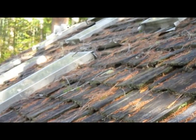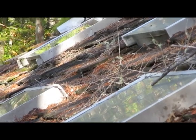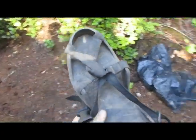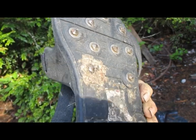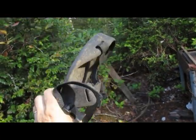That's it for the regular roof. Now I'm going to show you what I do about my skylights — there's a dam there and I put a piece of sheet metal underneath to keep the window from leaking. To walk around on a cedar shake roof I recommend using a rope tied onto something and draped over the house, plus a harness. You can buy sandal corks at a place that sells roofing materials — you can walk around on a wet cedar shake roof with these with no problem.